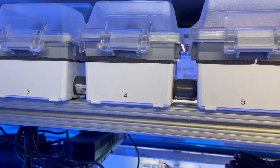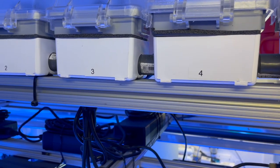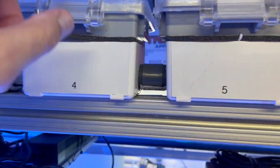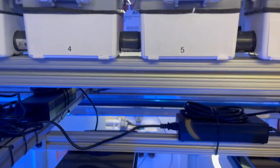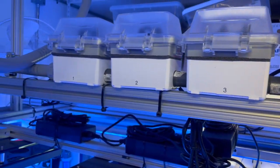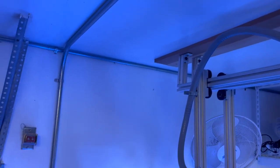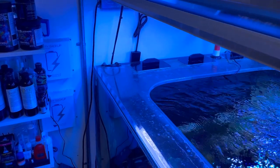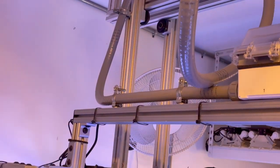Instead of having a whole bunch of wires hanging all over the place, I contacted a friend of mine who's an electrician. He went ahead and put a bunch of outlets up here, and we numbered them from one to six because I'm running different lights here. They open up and have a seal inside so salt creep won't get in there, keeping them dry. We then constructed this pull system, wired it in, and I'll show you the junction box in a minute.